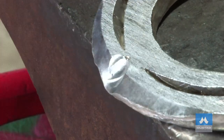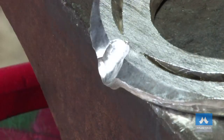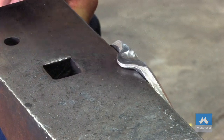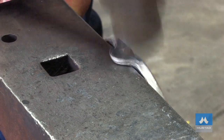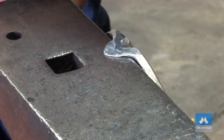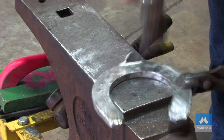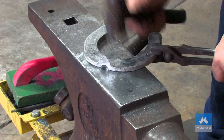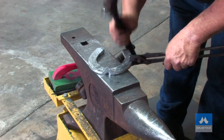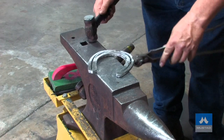I want a strong clip. This is aluminum — normal clipping process, but I hold a little bit more over so I end up with a bit thicker material. I want a thick clip. I don't want a weak clip on the aluminum. I'll level the back of the toe. I'll run my hammer around just to break the edge to seat it out, because it's a wide web shoe. Even though it doesn't show seating on the picture, I'll do it — it's good shoe making practice.